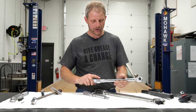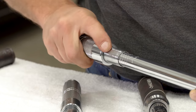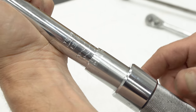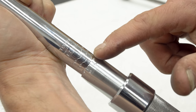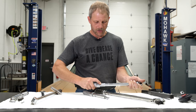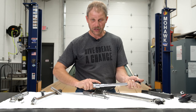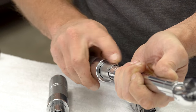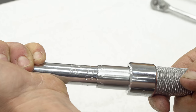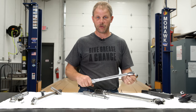To adjust these or set your torque value, you simply pull back the release and rotate the handle clockwise, compressing that internal spring. It has graduation marks on here. In this particular case it has macro adjustments of 10 foot-pound increments, and then micro adjustments of half a foot-pound of torque. You rotate this until you get to your value — say I zero at 50, and then I go to 55. Same general principle as a micrometer. At that point, this tool is ready to use — you're ready to torque to 55 foot-pounds. You will not get any feedback prior to 55; you will only get feedback at that over-center click right at 55 foot-pounds.